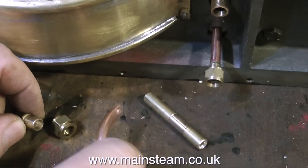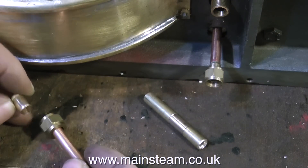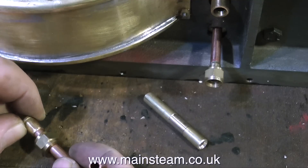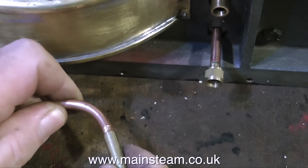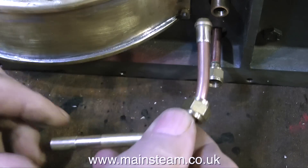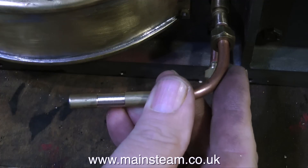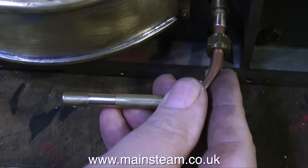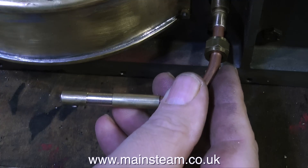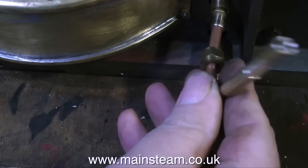With the water pump securely mounted to the bed plate, it's time to make some fittings. I'm using a piece of quarter inch pipe that I bent at 90 degrees, a union nut and a union cone, and a special part that I made in the lathe. I didn't bother showing this because it's almost identical to the part I made in the last episode, except that the fitting does not have the hexagon shaped part that was threaded to fit onto the existing unions. This one just has a quarter inch diameter hole drilled in the end to fit onto the pipe.